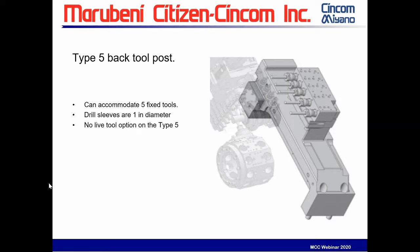Now the type 5 is slightly different. The back block has 5 fixed positions. None of these can be live. We do not have a live tool option for the type 5. It's also important to note that the type 5 is not a model that we will import and stock in the United States. It can be special ordered from the factory if necessary, but we are stocking the type 7 and type 8.